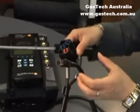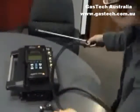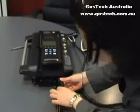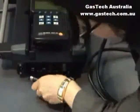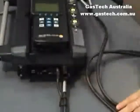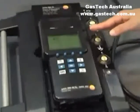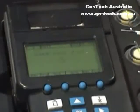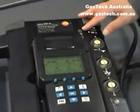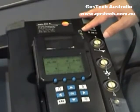Under sensors, one can calibrate sensors for carbon monoxide, sulfur dioxide, nitrogen dioxide, nitrogen monoxide and oxygen. Press sensors OK and there's the recalibrate option. There's also a sensor status which shows when it was last calibrated. To calibrate a sensor: press OK to recal, choose the sensor, press OK, enter the test gas concentration, and press N to accept the value. To save the nominal or actual value without calibrating press MEM, or press OK to calibrate. A test gas check can be carried out to verify the recalibration, and you can also check sensor status in the sensor menu.